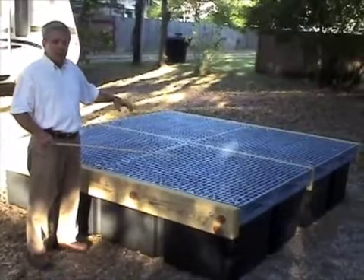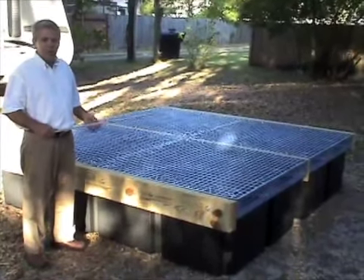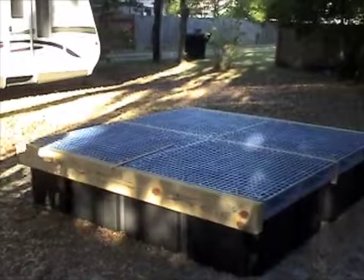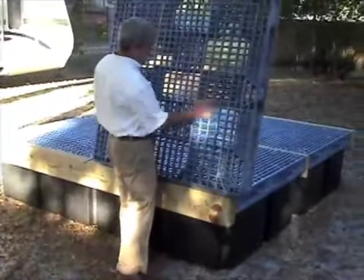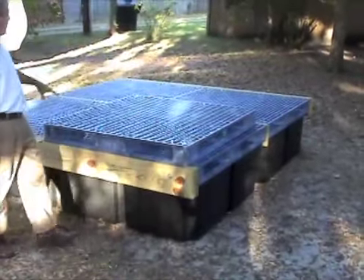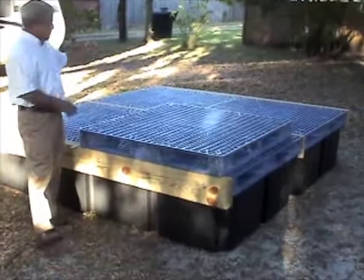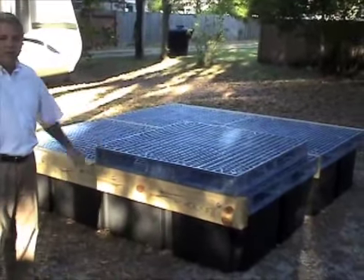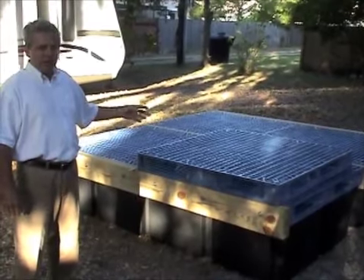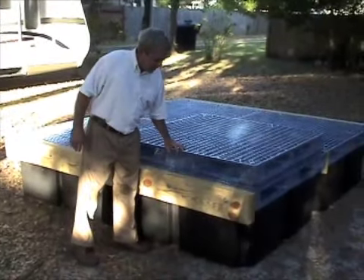That lends into the ability to distribute the product. We have a lightweight plastic part — we can get 7,000 square feet of these parts in one cargo container and one flatbed truck and ship them anywhere in the world. So your distribution costs are a lot less, and once they get there, you can walk over and grab one — very easily assembled. This section through-bolts to the bottom of a flotation device that's totally encapsulated. This section over here bolts the same way. Put two of them on one flotation device, two over there, bolt them together, run the rods through with the whalers and you're all done by hand. So when it gets to Indonesia or to Brazil or to Oklahoma or California, a novice crew can put the thing together. It's very simplistic. We're going to have these parts keyed together with the flotation device so you don't have to have any kind of specialized crew.